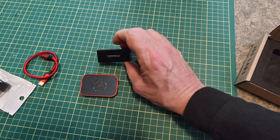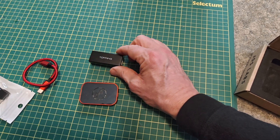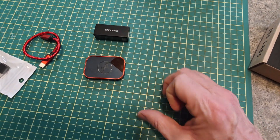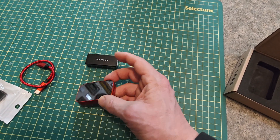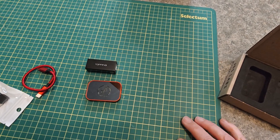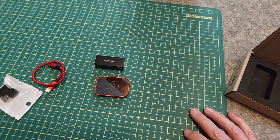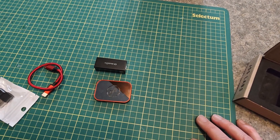There's no point in comparing the Synapse to the Topping HS01 because the HS01 is hit and miss — if you've got a problem it can solve, it can solve it, but not all problems get solved with that little device. The Synapse solves a whole lot more with galvanic isolation, really just eliminating the possibility of your noisy PC and its noisy power supply from having any impact whatsoever downstream.